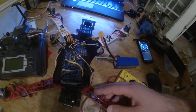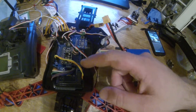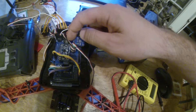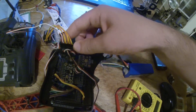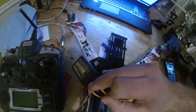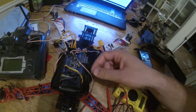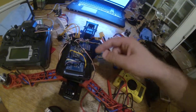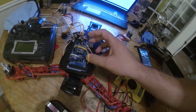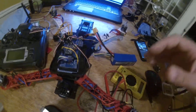Here's my flight controller — let me get a little closer. This is a little shield that I made just to make things easier. Right here is a three-axis gyro. Here is the pressure sensor, the barometer. Right here is the accelerometer. I've used the shield to solder in some points for the receiver inputs right here. The receiver is right here — it's just a standard Turnigy 9X receiver. Right here I soldered some points for the ESC outputs. It all plugs right into an Arduino Mega. This is the I2C connector and these are all the inputs, so I can switch up the pins. It will technically work on an Arduino Uno — you just have to knock it down to six channels input.